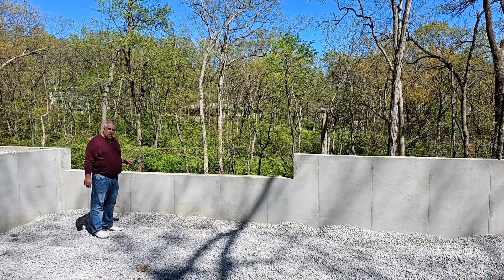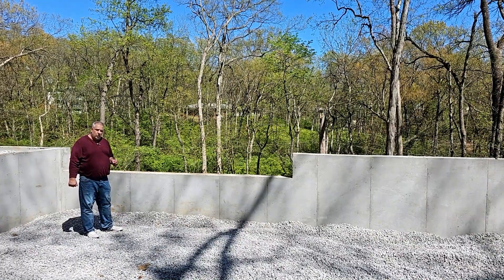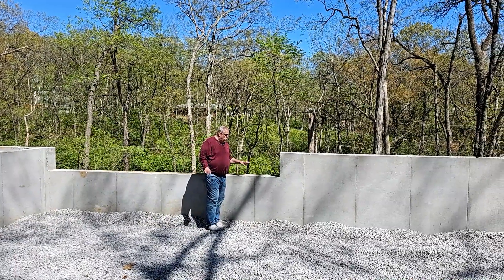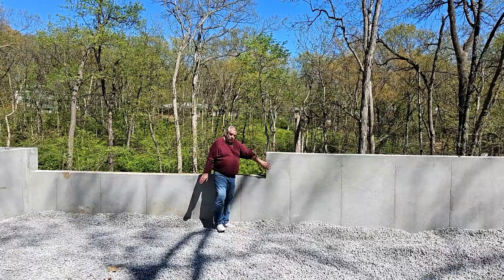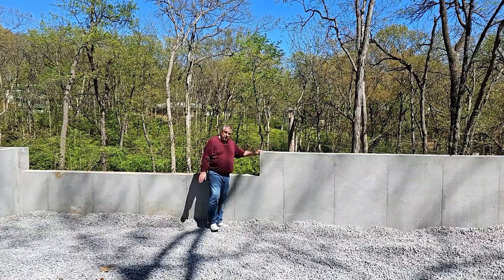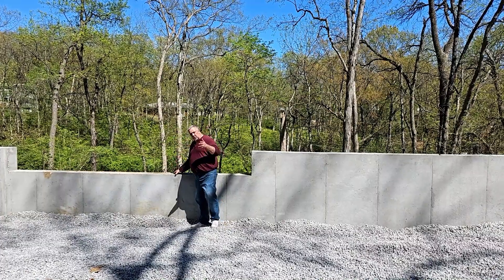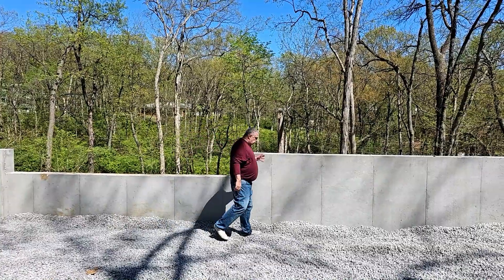All of that is going to be framed with an open web floor truss so that any mechanicals from this crawl space can run in there and move laterally through those open web floor trusses. We needed to be able to get into them, so rather than having this be the full wall height, we dropped it down. We'll have a double mud sill here and then hang the floor joists on the inside of the crawl space. Top of subfloor is three and three-quarters above this, so the mechanical system can run through here. We'll have a closure plate for that detail.